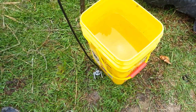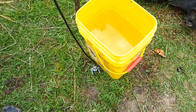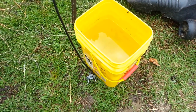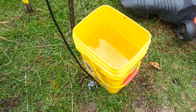It is all up and running. We've attached all the wires together, tested them, and they are all popping hot — as Tommy would say, they're popping. We've also incorporated what I'll call the Tommy Alderman rod watering device. When I asked Tommy about ground rods, the instructions said to put out three separate ground rods at almost 20 bucks a piece. Tommy said he only uses one, with a bucket next to it that has a little hole in it to keep the ground nice and moist. We had a ton of cat litter buckets, so we sacrificed one, put a hole in the bottom, and it's going to keep the ground moist. That's the Tommy Alderman ground rod watering system.